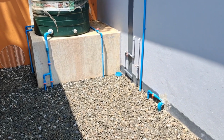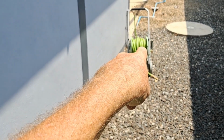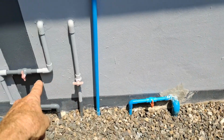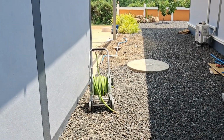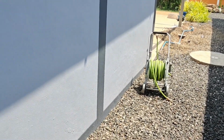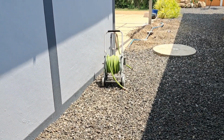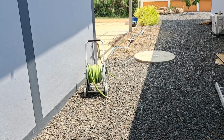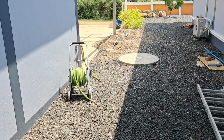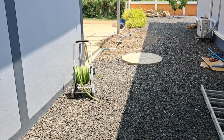So I turned that valve back on. So the water pressure is going down the side of the garage and going up to each of these stop valves and going right to the end of the garden. And of course the pump ran when I turned that valve so that it pressurised that line again. And I thought, right, let's just sit around for an hour, see how many times it recycles, see if it does recycle. And literally after 4 minutes the pump cycled again.